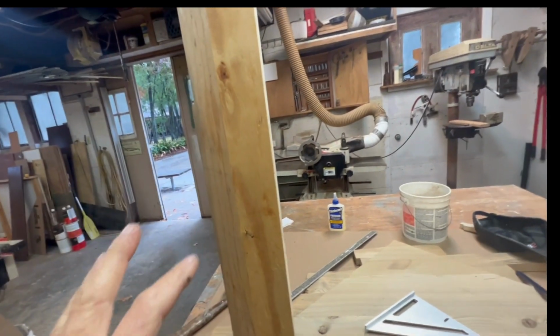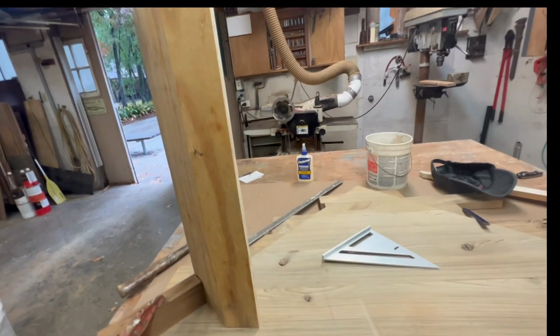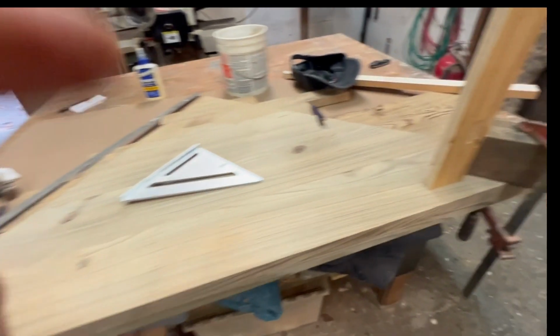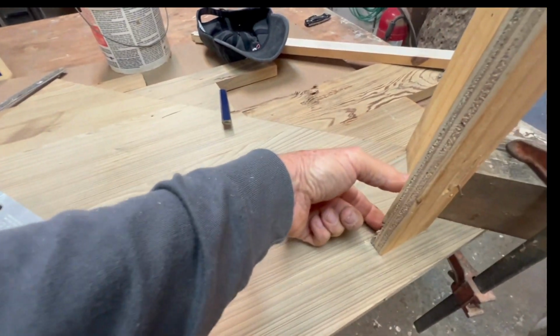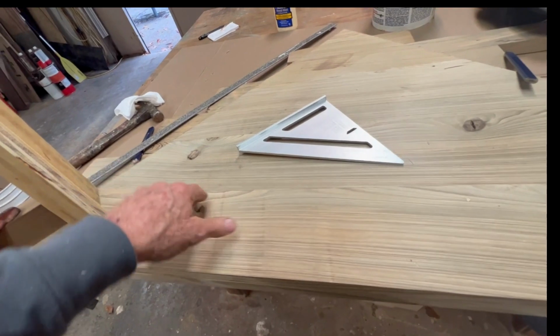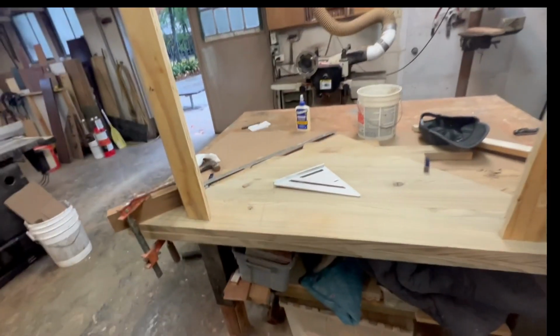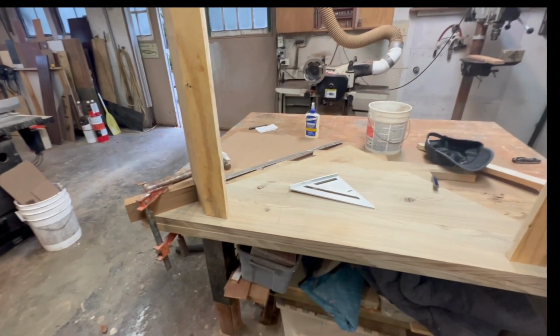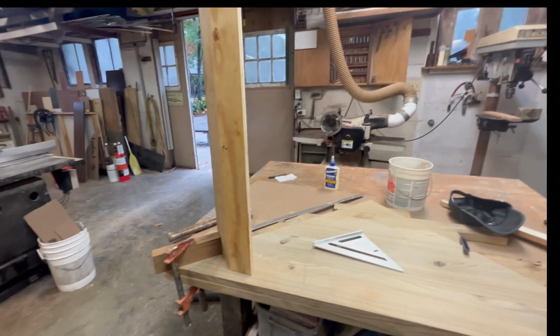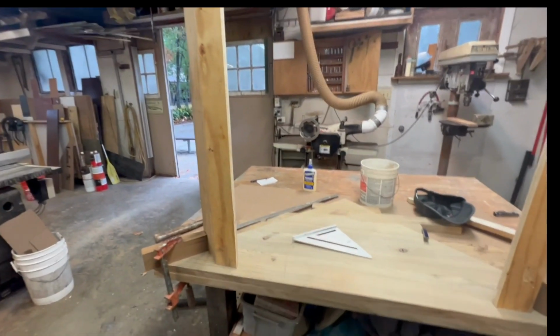I'm making all this out of junk wood so I can go inside and look at it and make sure it's what I want. And I'm not really going to put a toe kick, but I am going to put the bottom stile on the back of this. So whatever thickness material I have, I think it could be at least 3/4. The toe kick will be back 3/4, and then there'll be a platform and then 2 doors. So take a measurement and cut 2 stiles 2 inches, and I think I'll just throw some pocket screws in them. We'll put this together and then carry it inside.